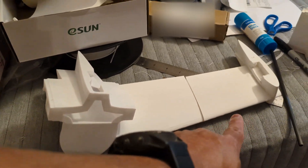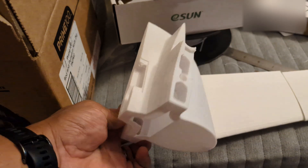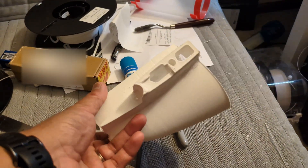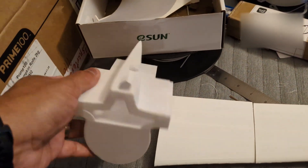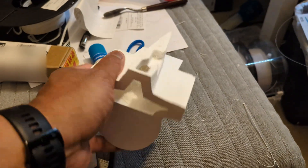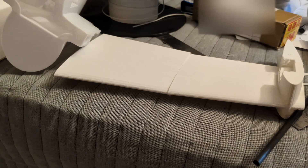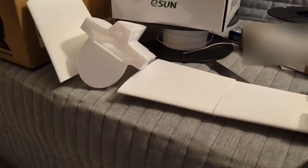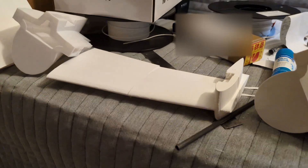I also did the last fuselage section — fuselage 12 — in PLA because I was going to do a majority PLA build, but just for comparison I also printed it in lightweight PLA. I did weigh them up: the PLA piece was around 41 grams, whereas the lightweight PLA was only about 21 grams. The lightweight is much less solid, but the regular PLA is noticeably more solid. I also forgot to mention — all the tail wing pieces, the stabilizers — I'm going to print those in lightweight PLA because, as I was chatting with the designer, he reckons I could achieve a better CG with lightweight PLA pieces.